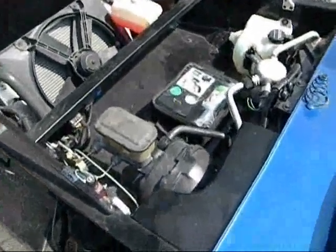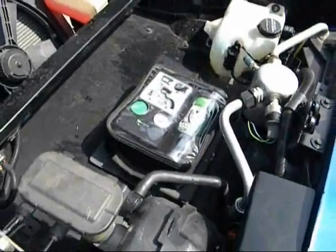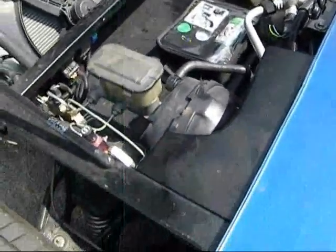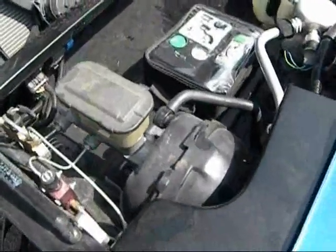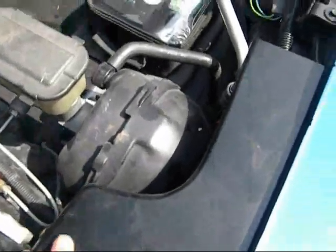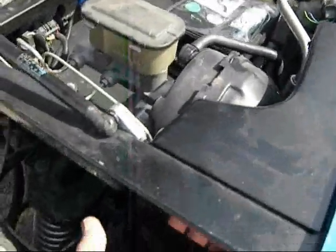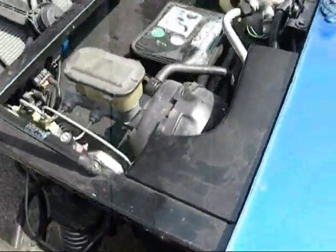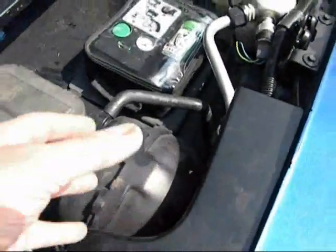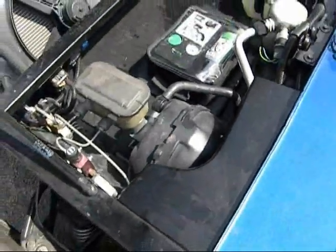This is the front compartment. Got that spare tire air refill thing, and there's a battery tray underneath there, the fiberglass cover. Your brake master cylinder and your hydraulic master cylinder is actually under this cover. This cover is an air box leading into the heating air conditioning system with a vent right through the side here. And there's two 7mm screws that hold it on. That can come off, and then underneath, right in this area, is the clutch master cylinder.